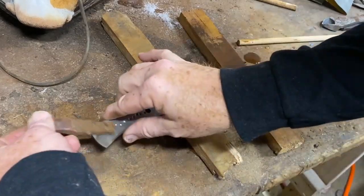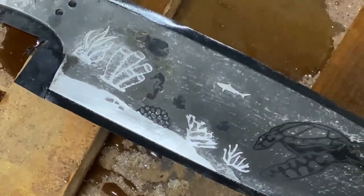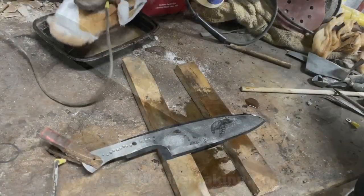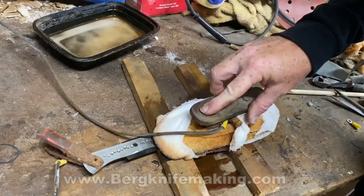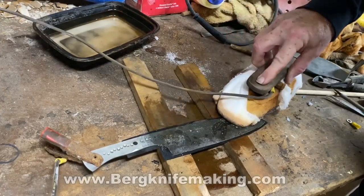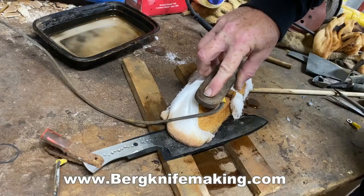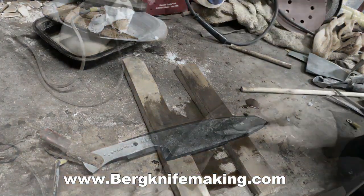Also in very short intervals — 10 to 15 seconds — and cool it frequently in fresh water. The last layer, layer three of this three-tone etching: I've now removed the vinyl from the background shark, the background sea turtle in the distance, as well as some of the coral. This is going to get etched for an even shorter amount of time — only about 30 seconds total. It's really the gauze that you use to wrap the electroplate that creates the pattern etched into the steel. If you weren't to move it around or change the angles, you would end up with a pretty distinct pattern from the gauze itself.